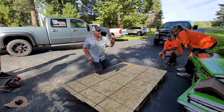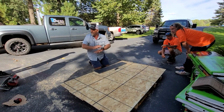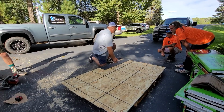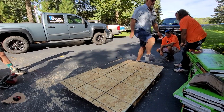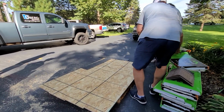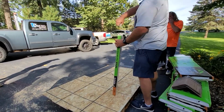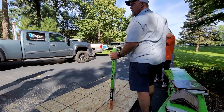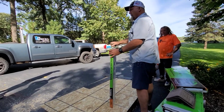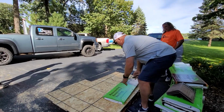These products, the wood shake, obviously the keyways don't have it, so it doesn't make a bit of difference. One thing that I'm going to share with you guys is completely different than asphalt shingles. Most guys will take shingles like this, and you typically cut it here and you pull it through like this, right? You don't want to do that. At least that's what I see with most crews. They'll cut here and then they pull the shingle through. You don't want to do that with this because of the adhesive.